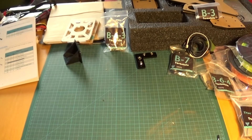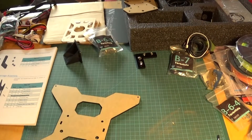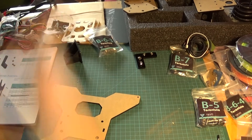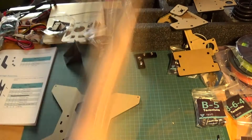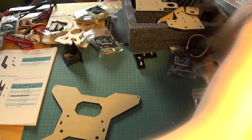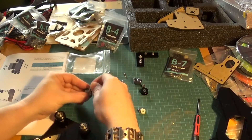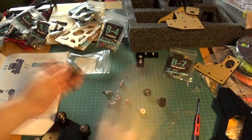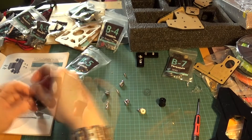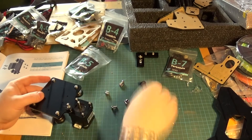A lot of the advertising and other reviews say it comes with two rolls of filament, but they're both 200 grams each — combined that's only 400 grams, less than a half roll. Filament normally comes in 500g or 1kg sizes. Some reviews mention you get ABS and PLA; I got two rolls of PLA, and neither could be printed without bed temperature. I had to raise the bed to 60°C to get either to stick for more than the first two layers, and even then there were adhesion issues.